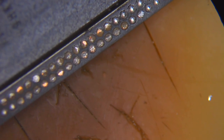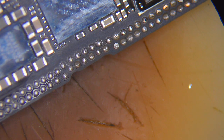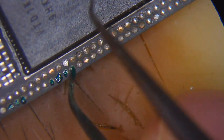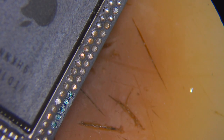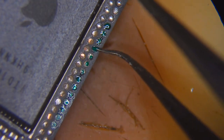We cleaned the board from flux. This time I'm not going to clean the pads immediately because I'm going to make jumpers or put soldering pads on the missing holes. We don't want to contaminate the clean pads. I'm putting a green solder mask on the ground pads — they're not strictly necessary for board function individually, but ground is important overall — to avoid shorts when soldering both boards back together.